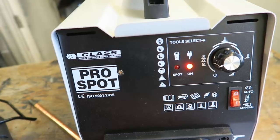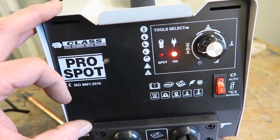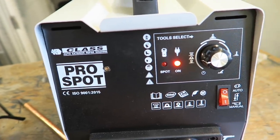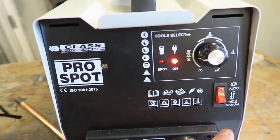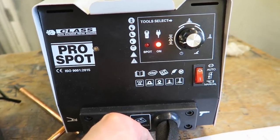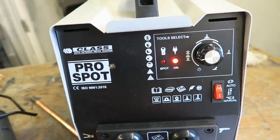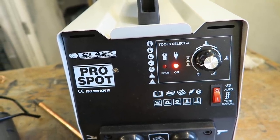This would have made the machine much more practical with other tools because then you wouldn't need a trigger. You've always got to factor in some kind of triggering mode, which this doesn't have in automatic — though we are talking a Chinese direct translation, so you've got to look at it through that lens. What I could do is break into the trigger wiring and put a foot switch on the floor, which would free both hands up — just a simple on/off switch in a plastic box fed back to the welder, and I'd just put my foot on it to send the pulse. No big deal really.